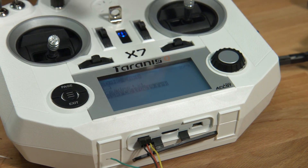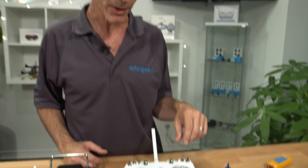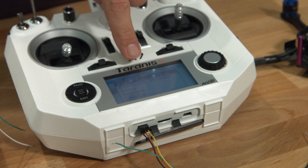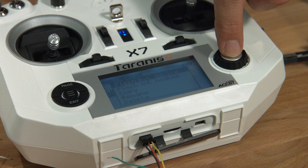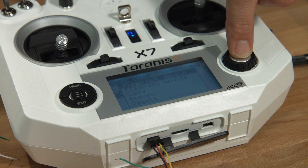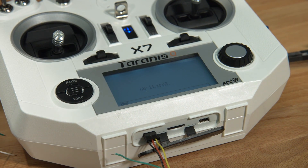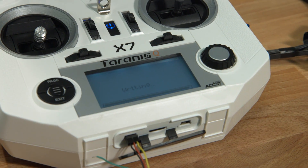By the way, FCC is the code for North American radios; the other one would be the European code. You need to match up the receiver with the radio or it won't work at all. So I'm in North America, I'm using FCC. Select the firmware, hold the button down, and then choose 'flash the external device'. As soon as you press that button, it will start communicating with the XSR and flash it. It takes about a minute and 15 seconds. It finishes rather uneventfully — it'll just return back to the other screen.